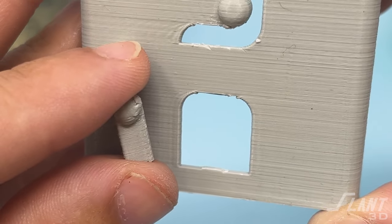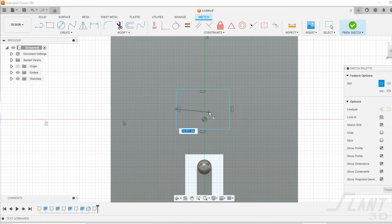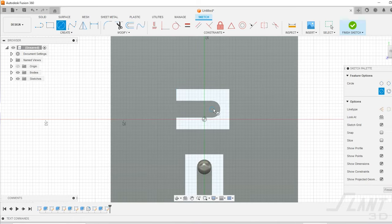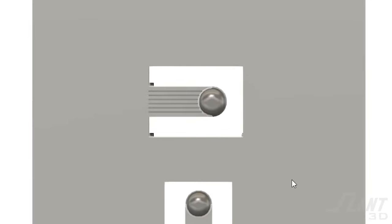But there is no reason for this to occur. It's mating at a circular component, and the flexure of the part really doesn't matter what axis it's occurring within. So why don't we just take that and turn it sideways? If you turn it sideways, now that tab is operating within the layer lines. Each layer line acts as an individual part of that spring, so there's no possibility it will ever fatigue or break the way it would if the layer lines were going perpendicular across the part. This way, you have the same amount of flexure as you would with any typical isotropic part, and you make it actually easier to 3D print.